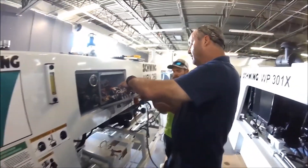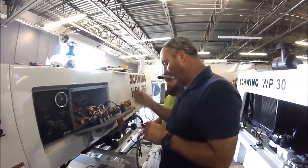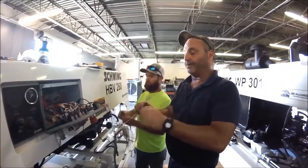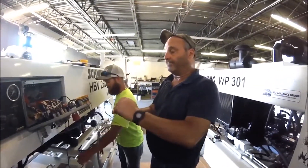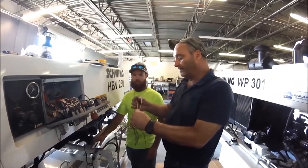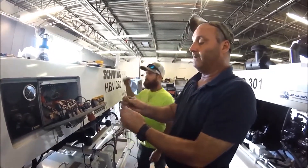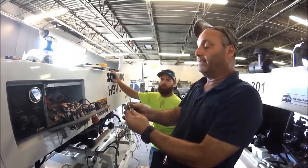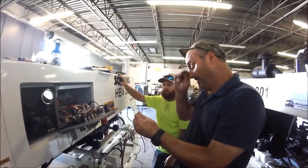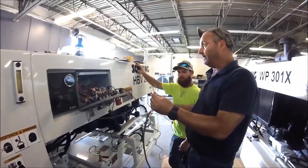So if you can think of this — you're going to be hooking your gray wire and your white wire together, and that's going to be for your power on your toggle switch. Then you're going to hook your yellow wire for reverse and the green wire for forward. So those four wires you're going to use for forward and reverse. And then you've got your accessories if you have them.